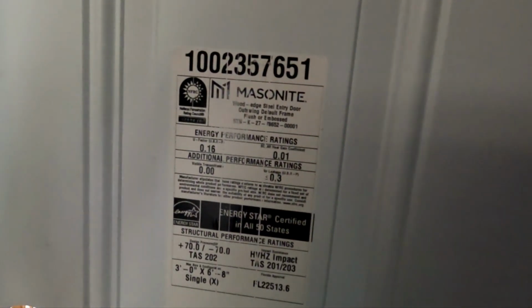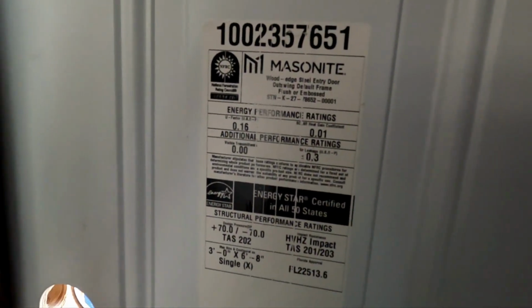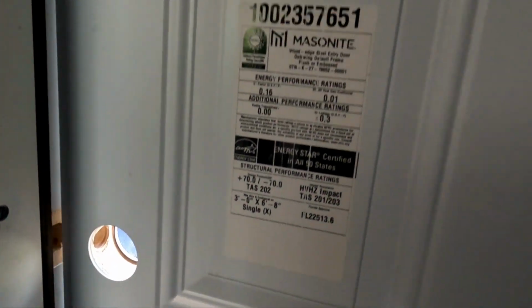I'm gonna clean up. I'm gonna throw a little trim around the outside and put the lock, deadbolt and the doorknob on from the old door. I'm not buying new stuff. So anyways, it's in. I'll get a finished shot of it. Not fun though, having to cut all this concrete. It's way easier to shim a door than it is to cut the stuff out of the way.